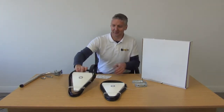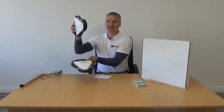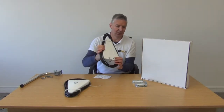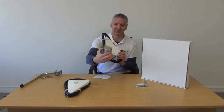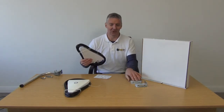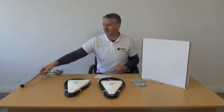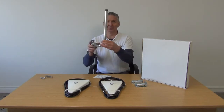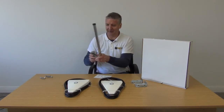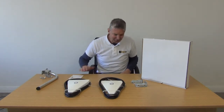Looking at this image, what we'll have is it mounted on a pole, 90 degrees to each other. For the bracketry, there are two bolts, two screws, some washers, and these brackets. The new bolts grip onto a pole at two closely spaced locations. The small bracket gives just enough room to mount this discretely and at low cost — mounting the first aerial at the top, and the second at the 90-degree angle, ensuring the aerials are not interfering with each other.